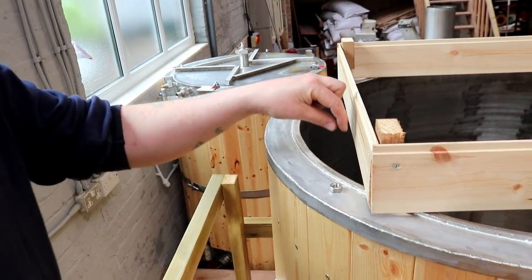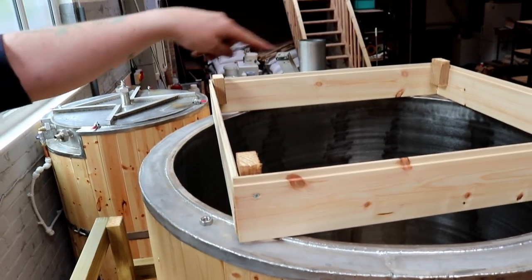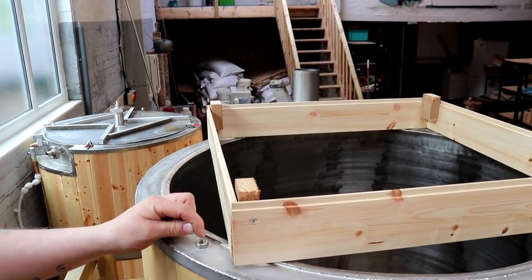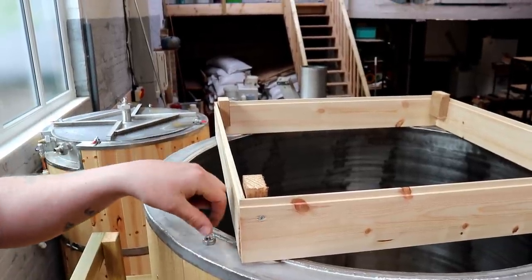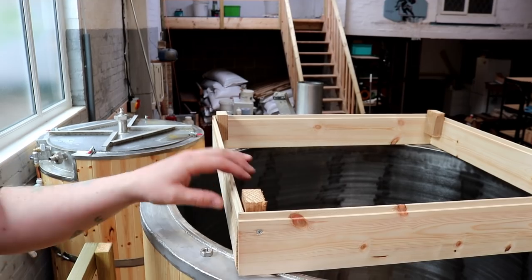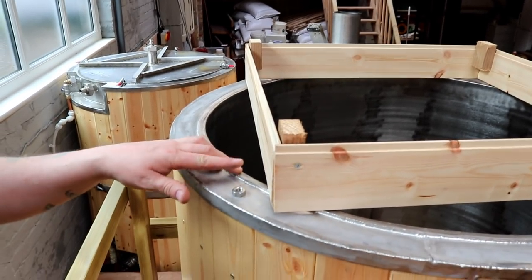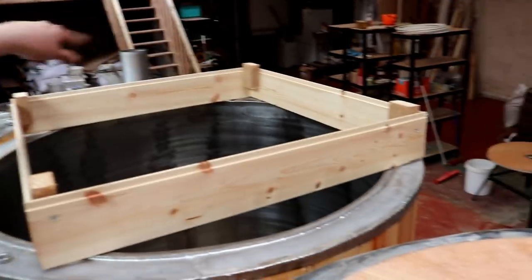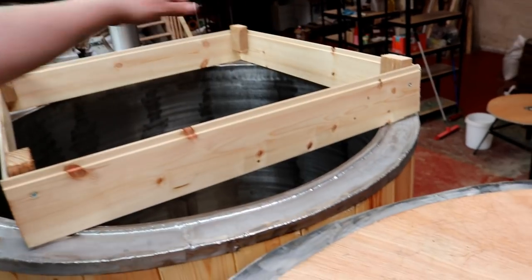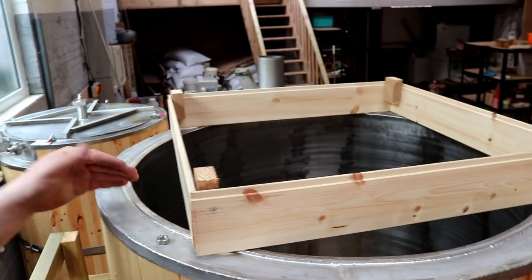Then when you've got your box section, this is what the box section is going to look like, out of 1-inch box. Hole drilled through it, exactly where these nuts are. Drop your threaded bar through, screw it into the nut. Not fouling the lid, because it's such a low profile nut. And easy to undo. And the way this is set up, it's putting pressure on the extremity of the lid. So that will hold it down nicely.